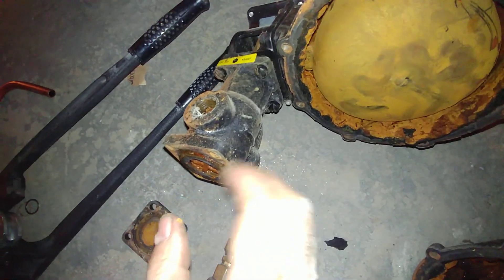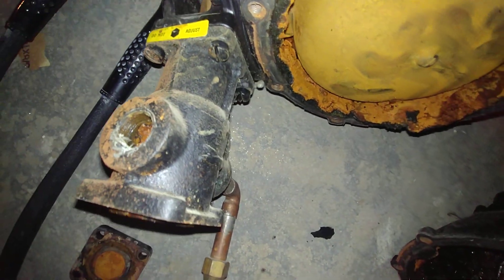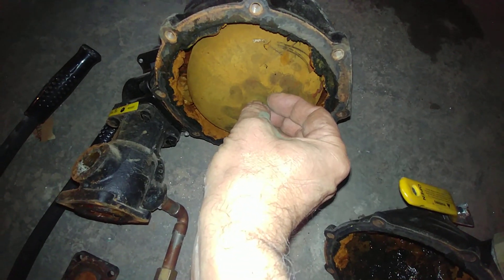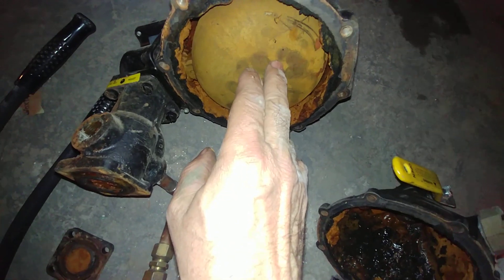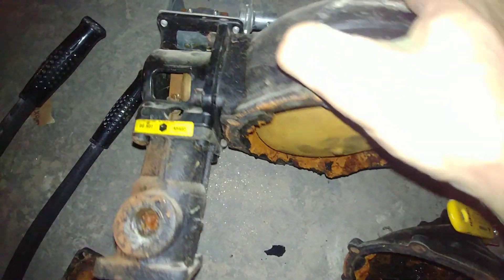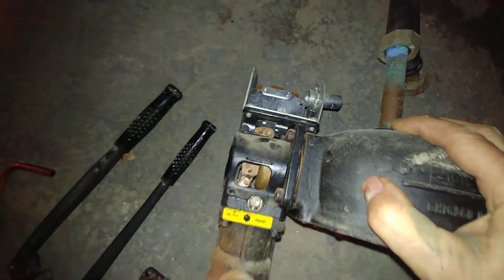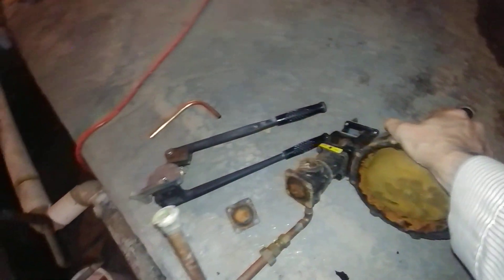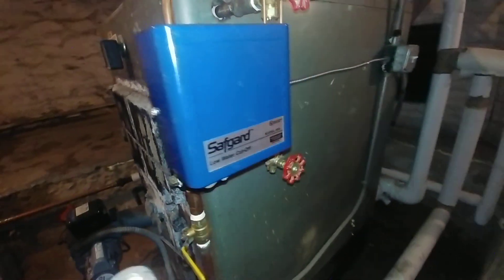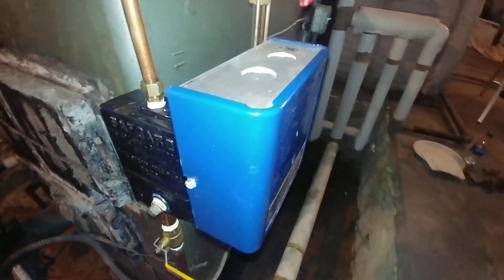Normally there'd be a strainer attached to this, but when I took it off the feed block it just broke off — completely rusted up. The main reason we had to replace this was because the pancake float inside became waterlogged. It developed a hole, the water filled it, and it dropped. It wouldn't float back up and shut off the switch, which cut off the burner.